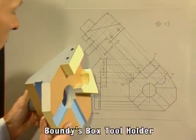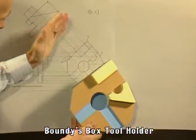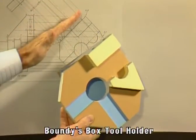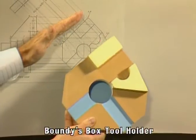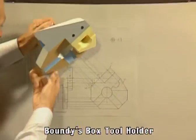First of all, we go back to the front elevation, because on the front elevation that plane there is the face that we want, and it's going straight into the page. So we can just rotate round on that face to get our auxiliary view.